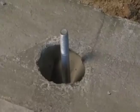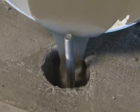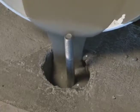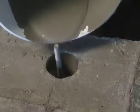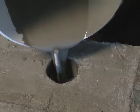Pour the anchor cement into the cavity, filling it completely. If used in an environment where the patch will get wet, overfill the hole slightly, and as it stiffens, gently slope the material so that water will move away from the patch.